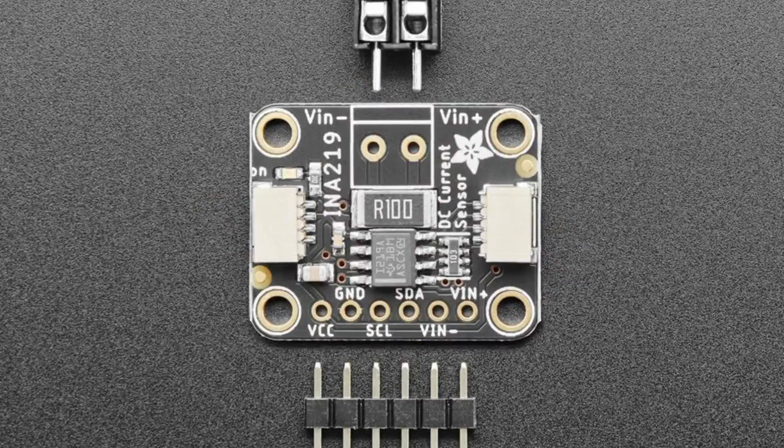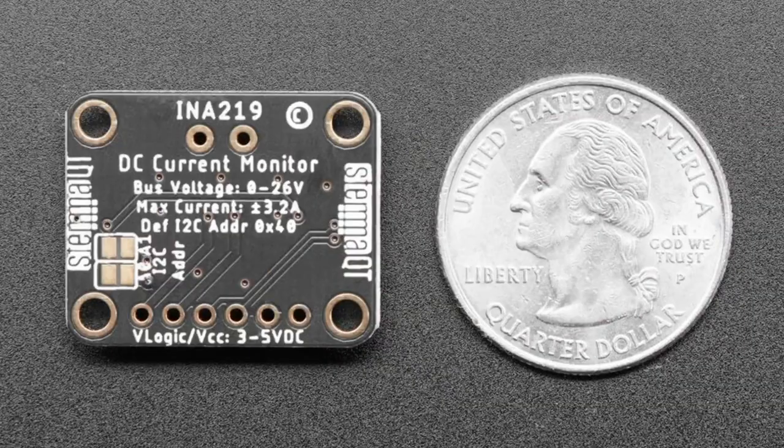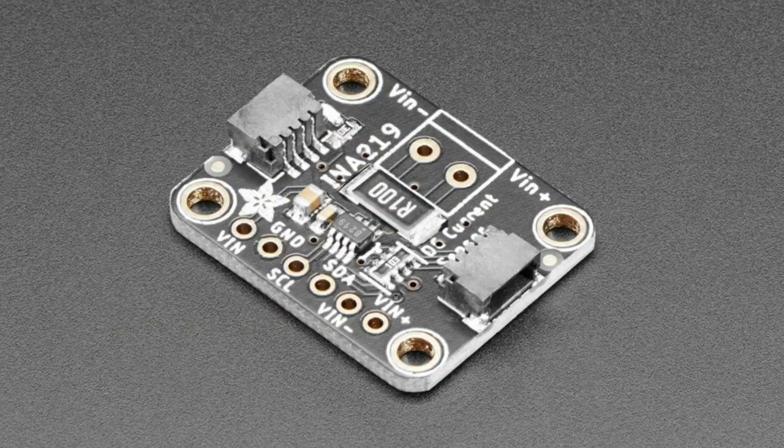So we revised it, and it looks a little different, and I want to explain what changed. So we could not get the INA219B, which is the version of the SOT23 chip that we've been using for a really long time. So instead, what we did is we revised the board to use an SOIC-sized chip. So the chip is bigger, and it's the INA219A, not just the 219B. The difference is the 219B, I think, is 0.5% precision, and the 219A is 1% precision.